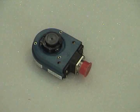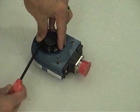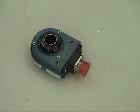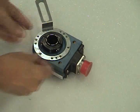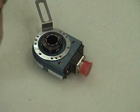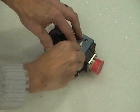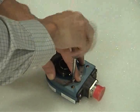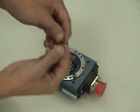To begin the installation, prepare the HS35M. Loosen both clamping collar screws. Note that HS35M clamping collar screws have factory-applied threadlocker, so no further threadlocker application is required. Remove the factory-installed shaft plug if one is provided. Install the anti-rotation bracket to the face of the encoder using the included screws and lock washers. Do not use threadlocker.